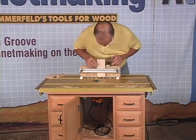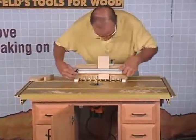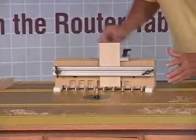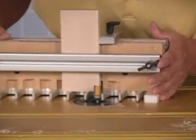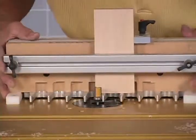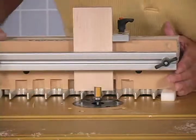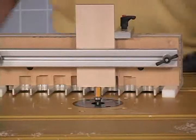Okay, we don't move this position of this stop. That comes over, sets, and again, we clamp. All right, now, when we do this, there's a bearing on here too. I always start on the left side over here, and I'm going to come into here on the bearing even and cut into here, come down this one, come here. And here, I don't want to come here first. I want to come out here and clean the outside so I don't get any chipping done. So if you got something that's in an open space like this, come to the outside first and clear that out, and then come on the inside. You'll watch how we do it here.